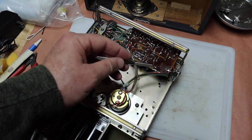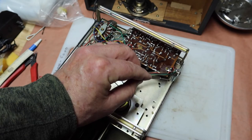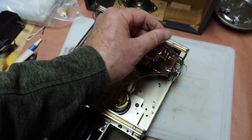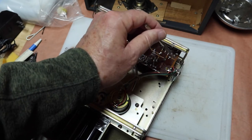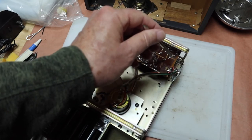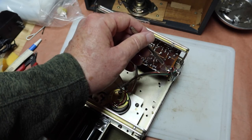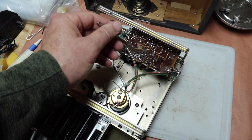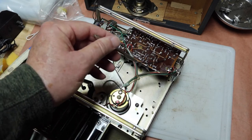Then the other lead that is switched comes into basically a single pole, single throw switch that's operated in here by this jack by plugging in the plug. Okay, so you have one of the leads goes here as a potential source that is usually in, which is the batteries. And then if you put in a plug, then the tip of that plug now becomes alternate source 2. It disconnects source 1, the batteries, and then it sends its source 2 to the output, which is output then to the radio.